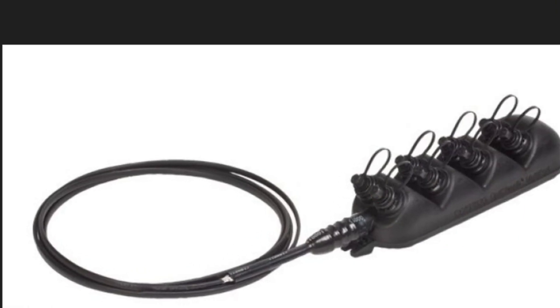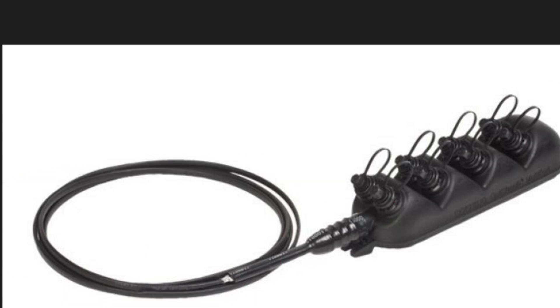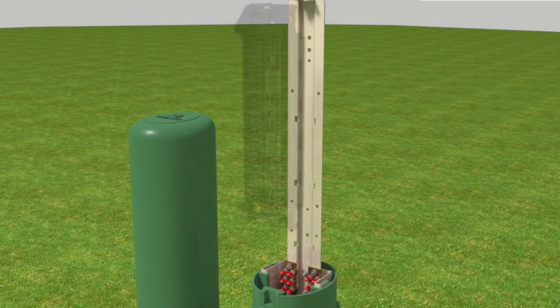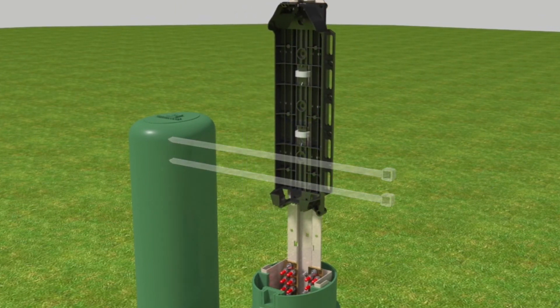When you look into the drop pad, you'll be seeing something like this. This is the 8-core fiber drop. You've got all the connections here where it's quick-play — they can plug in and run the fiber optic drop from this drop pad. This is the feed coming in from the Charleston pad. From the Charleston pad, you've got a feed coming through — it could be a 12-count, it could be a 24-count. It all depends on how many houses AT&T is feeding.